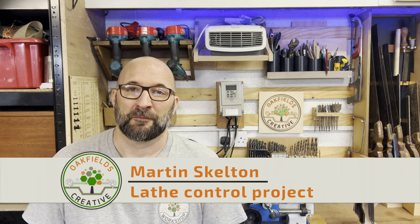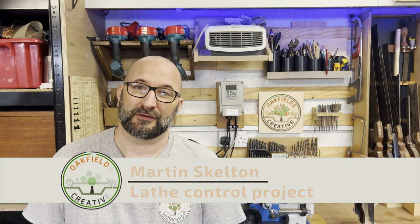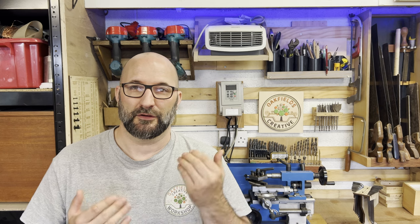Hey guys, welcome to today's video. This is the second part of my lathe series where I'm rebuilding my Chinese mini lathe. The first part was converting the motor to a VFD drive — if you haven't seen that already, check out the cut scene. This part covers the topic of the controller unit, because implementing the VFD drive meant the controls were no longer on the lathe. The main motivation is safety — I want that stop button by the lathe, not at the inverter, and I wanted the speed control to hand so I'm not leaning over the machine.